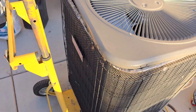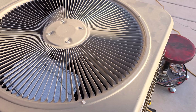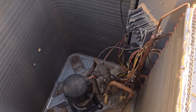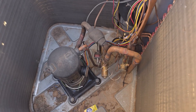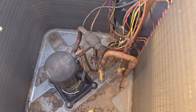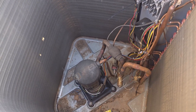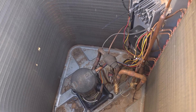I since then took the solar power and got it going through an actual hybrid charger inverter unit that runs lithium-ion batteries. Before that I was messing around with that solar power doing that. So this was a straight cool, and I converted it to a heat pump. I added a reversing valve and a thermal expansion valve, plus a check valve at the bottom.